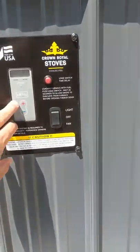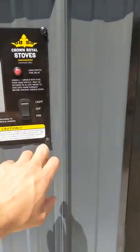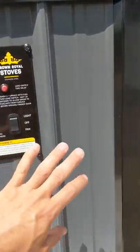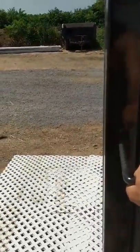Simple controls — Emerson digital aquastat. Simple controls: light on, fan on, furnace on. You've got your load switch, so when you come out to load, you press that and for 100 seconds it's going to turn on the fan and suck all the air out of the combustion chamber. Here is your shaker handle for your heat exchange tubes — very simple, right at the loading door.